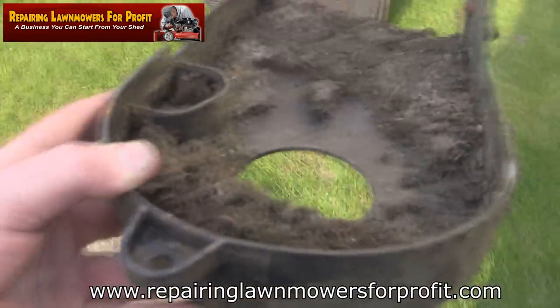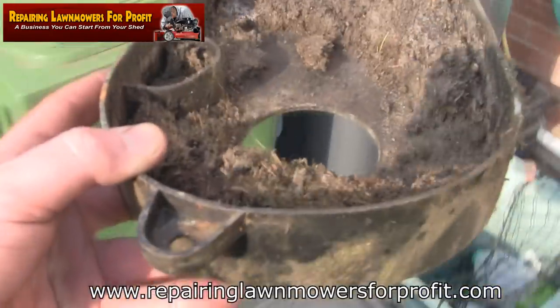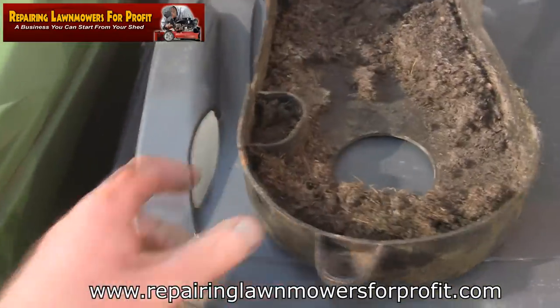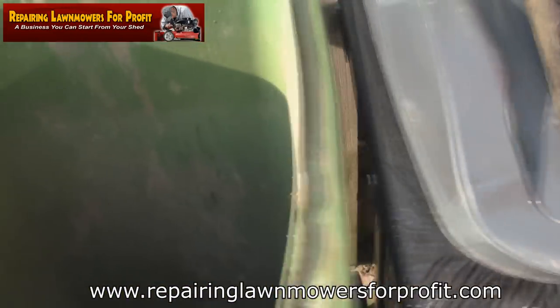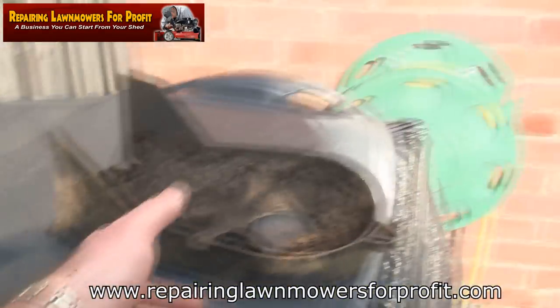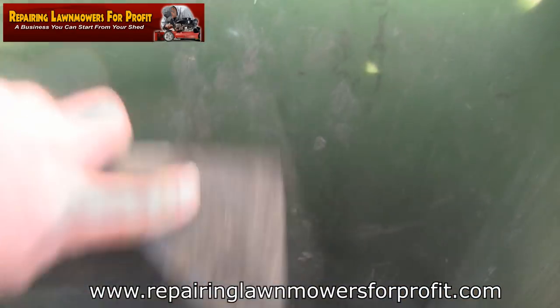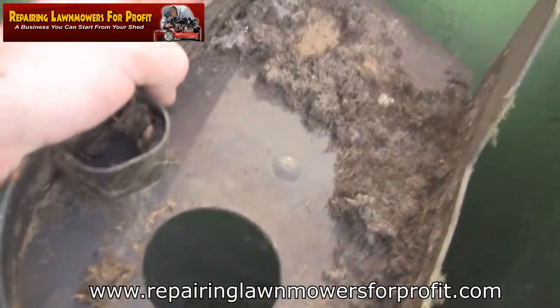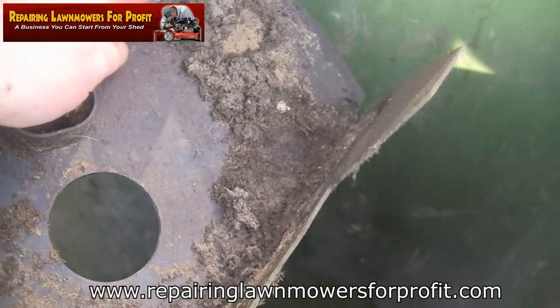You know, when you kneel down for too long. This is one of the common reasons that the drive belts get dragged off - these areas get filled up with really long grass and the next thing you know it's ragging the belt off. So let's just brush that off a bit as well. I'll clean that out with my hand when I've put this camera down, and that will just stop this belt coming off.